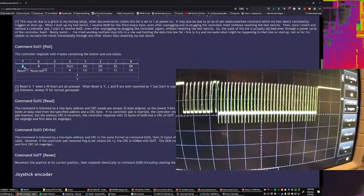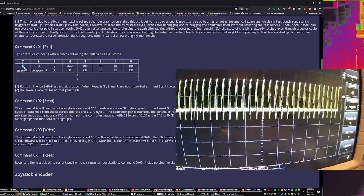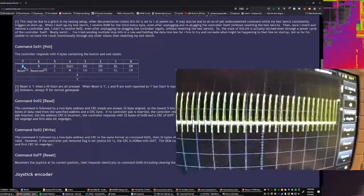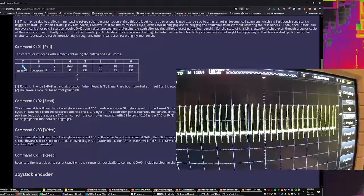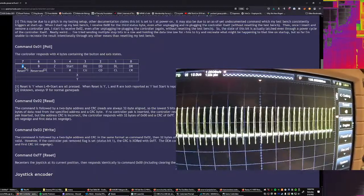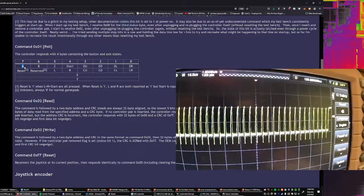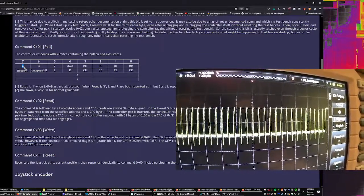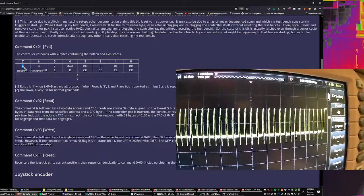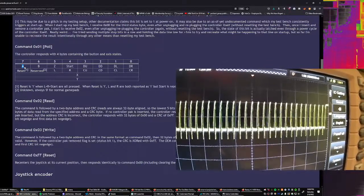So it looks like the controller is actually sending what should be meaningful bits. I'm going to guess it's the timing. Yeah, the controller's responding. We have two unknown systems that seem to be following a protocol, but those curves are way too much. So I think if we fix the curves on the ends of these bits, we'd probably get back to a reasonable system.